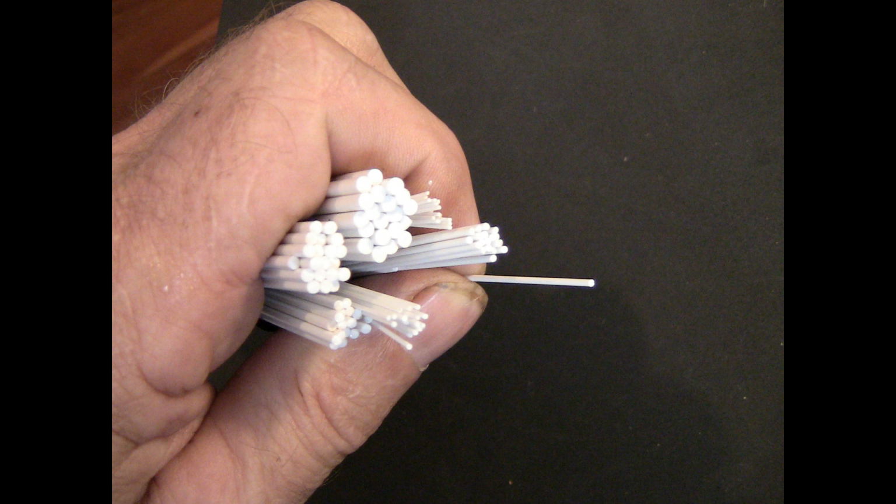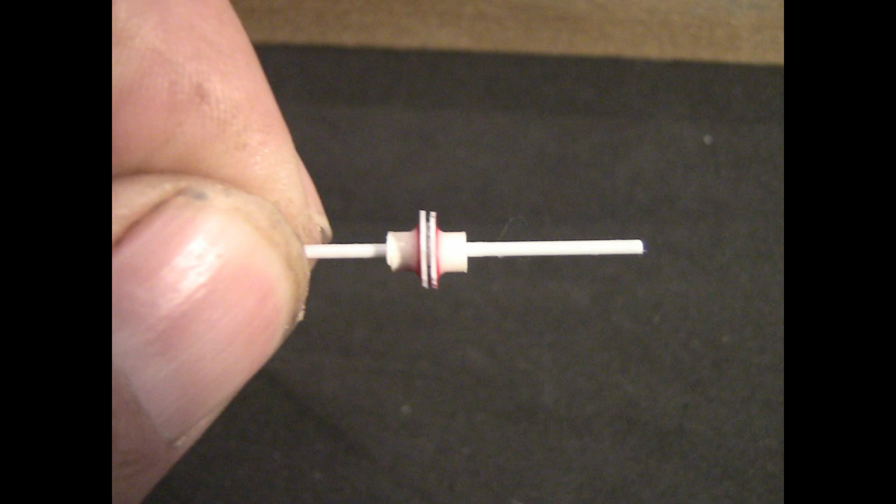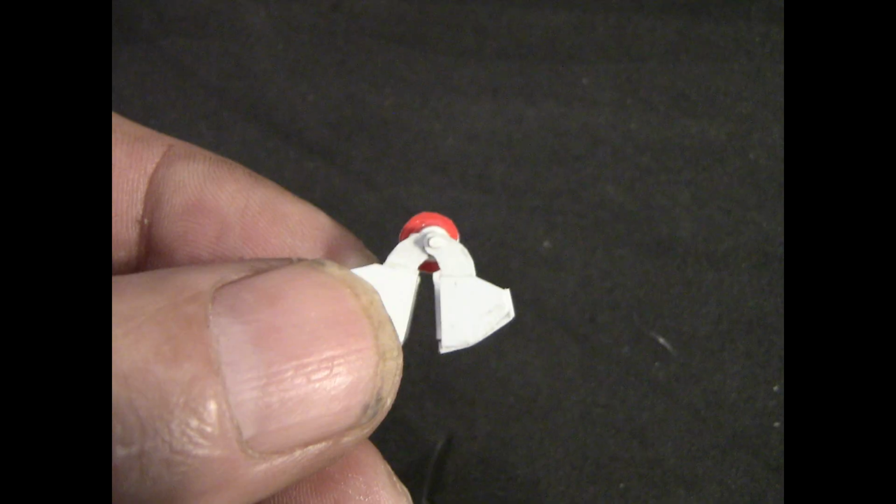And there are several different round stocks I need to use for this for various things. And here's just a picture of the bulk round stock that I bought on eBay. It's relatively cheap. But that same piece that I had picked out before will also go through this pulley. So I came back and drilled a hole on this that matches those arms on top of the bucket. And then between the pulley and those arms, there's some gap, and I didn't want everything to move back and forth, so I also cut these styrene cylinders to use as spacers between the arms of the bucket and this pulley, which would go in the middle. And this whole system, once it goes into the bucket here, will allow it to open like a clamshell operation. It'll open and close.